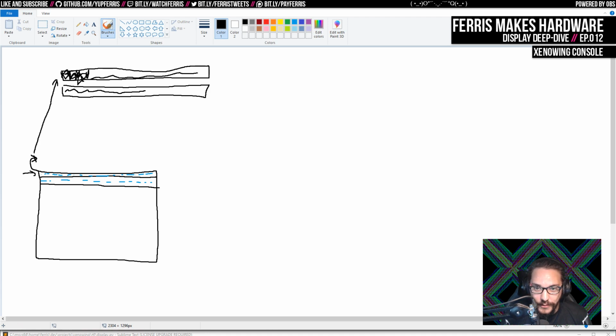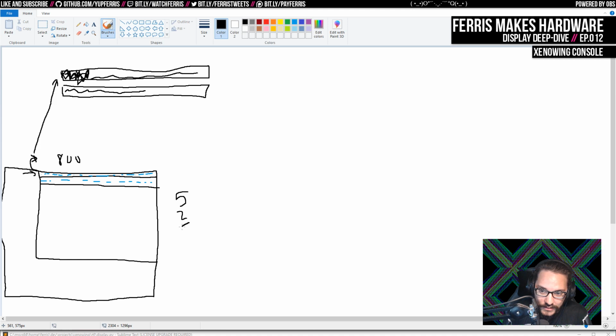so I think these fill up actually quite fast. And this isn't actually a complete picture of the frame because there's blanking periods as well. So it's actually more like this. It's 800 by 525. I don't know why I wrote that vertically. So there's these blanking periods, and then also somewhere in here you have the H syncs and the V sync, something like that. I think that's a good way to draw that.